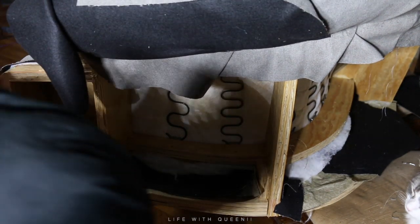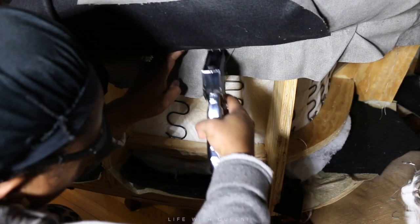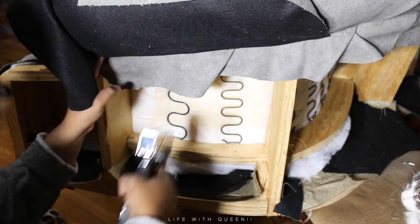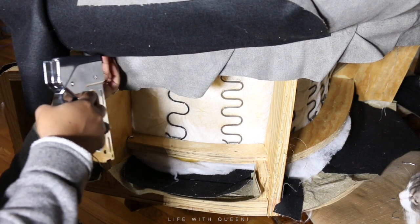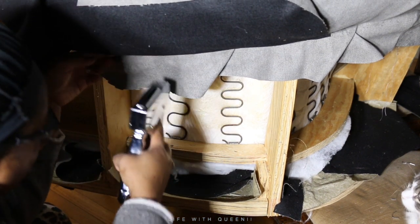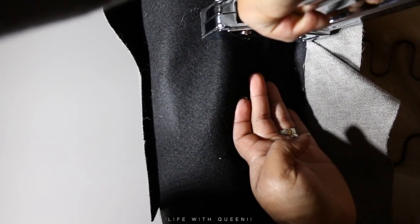Make sure you check your staples — go back and forth and make sure you have them positioned correctly. I'm pushing my staple gun up so I can get the seam staple closer to the curve underneath the arm. Pushing up the staples gets them close enough to give that seamless look, almost like it was stitched on. This is an underside view so you can see how it looks.